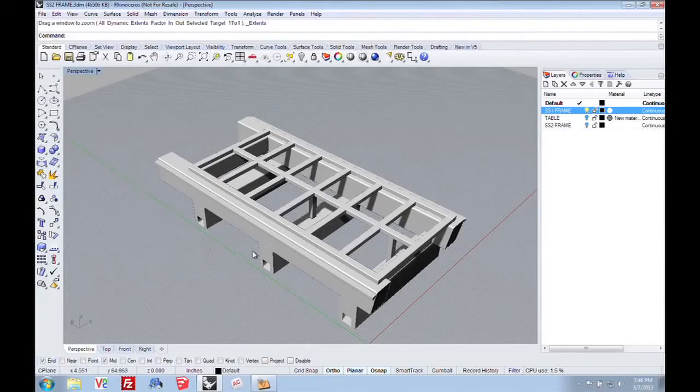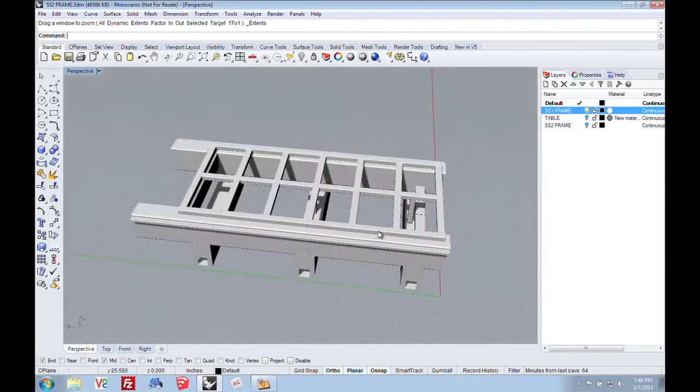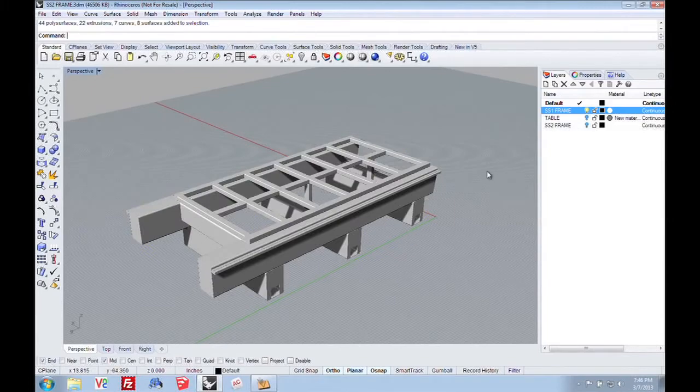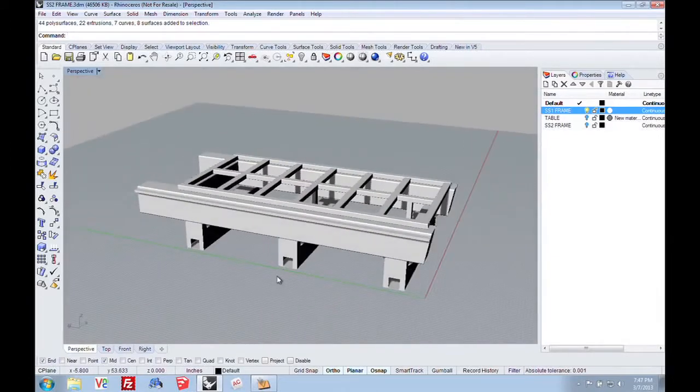This is the new design of the Smart Shop one frame. If you notice, it's very similar to the Smart Shop two, and here's why we did that. The Smart Shop machines create unbelievable edge finishes — straight edges, no chatter, high precision. The reason for that is real simple: this is a one-piece frame, one welded assembly of tubular steel, all tied together. That's what makes the machine work. In machine tool design, if you don't have that frame, it doesn't matter what you hang on the rest of it.